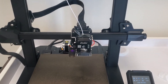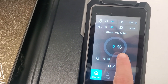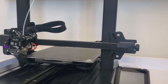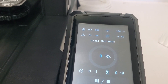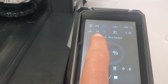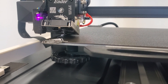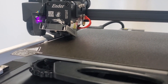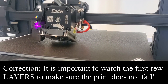At this point the printer is getting itself set up and is going to start printing. The percentage shown on screen is how far the print is done — if it's at 30%, the print is 30% of the way done. Do not get alarmed if the printer sits for a while; it's just getting up to temperature. Both the nozzle and print bed need to reach temperature. Once ready, it will print a priming line — that's normal, just getting the filament going. It's important that you stay for the first few prints to make sure it is printing correctly, as failures usually happen at the beginning.